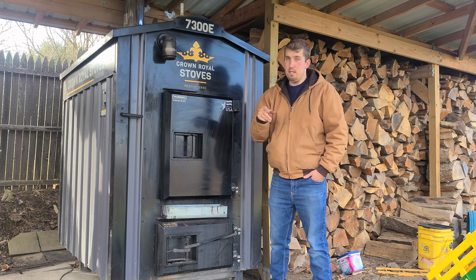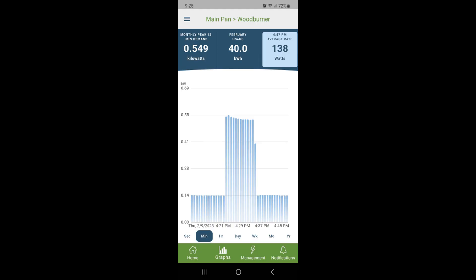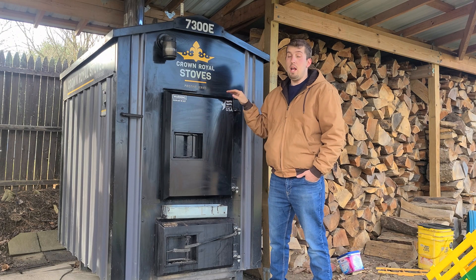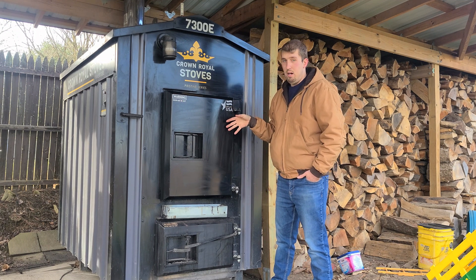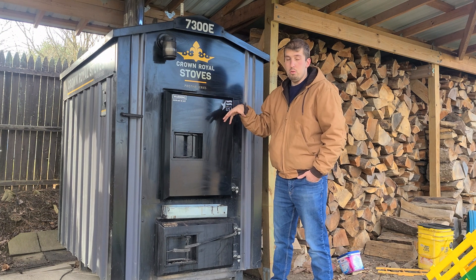Looking at it from a minute perspective, it shows nice bar graphs with time history. I know that this wood burner takes about 10 to 13 minutes to heat up from the 170 to 180 degrees that I have it set to. If it takes longer than that — let's say it has to run for 20 or 30 minutes — I know I have some sort of issue. The issue being either it's out of wood, or like I had the other day, since my nozzle is kind of worn out, it got choked with coals and wasn't getting enough airflow to actually heat up.